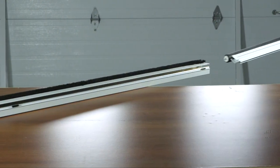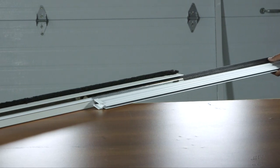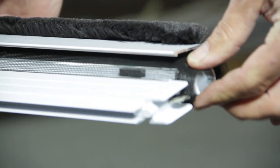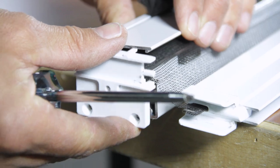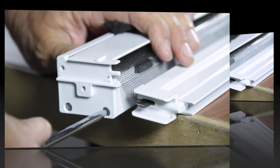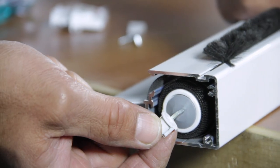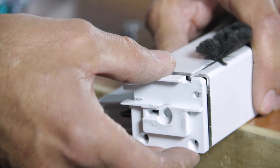Place the casing on the table with the weather strip on top, and insert the roll into the casing, keeping the handle extrusion identified with the masking tape facing upwards. Replace the fixed cap on the casing by inserting the ferrule on the roller into the hole in the fixed cap and attach it with the two screws. Insert the round mechanism on the spring rod. Install the mechanized cap and fix everything in place with the two screws.